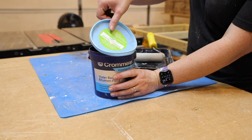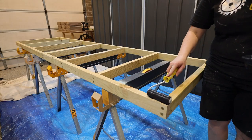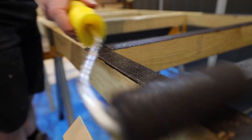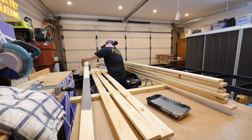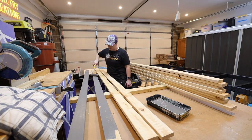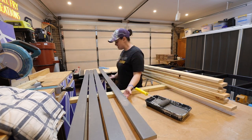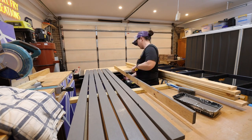The bitumen paint is thick but very easy to apply. It dries in about 24 hours but still has a little tack to it — it fully cures in seven days. To finish the day off I painted the deck slats so they could dry overnight. They are treated pine and the cheapest option. You're never going to see them, and this is a great choice especially if you're going to paint them.